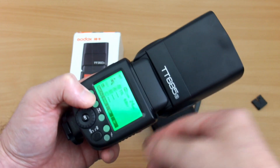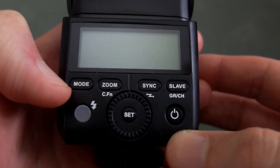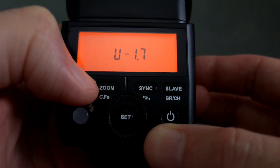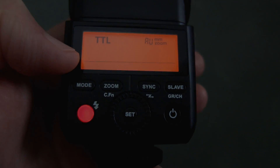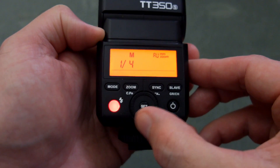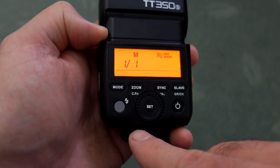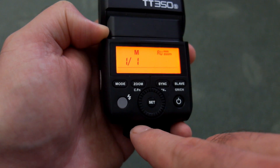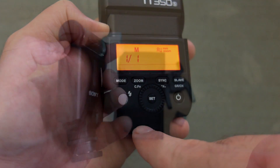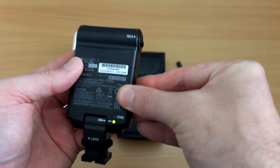I will be doing a full review on the 685S in a week or so. If you hold the mode button while turning the power on, that brings up the firmware version - we're at version 1.7, so there may be future firmware updates. Doing a flash recycle test at full power, I've been getting around three to four seconds recycle time, which is not as fast as the specified 2.2 seconds. I haven't been able to achieve that speed with the batteries I've tested.